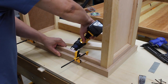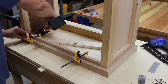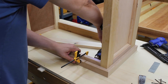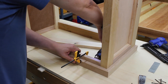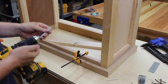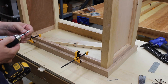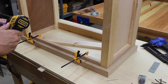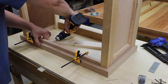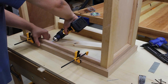I have to do that sometimes — the wood I get isn't perfect, and some of these pieces might have 20 to 50 percent of wood from another project in them. I'm okay with that when working on projects for myself. Here I drilled the pilot hole and I'm going to put a couple of screws through the back — it'll hold the front on. I like that it's invisible; it just pulls it in against the face frame nice and tight.